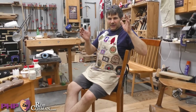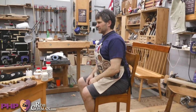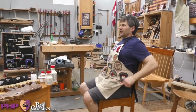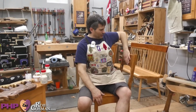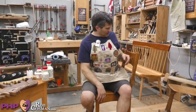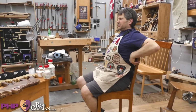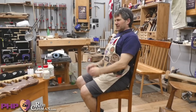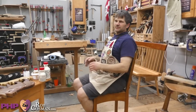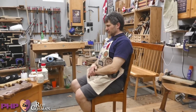So you've got to have the right angle tilting back. I've seen commercially available chairs where the back was straight up, and that's extremely uncomfortable. It's got you pushing forward like that. So you want just enough. When I did this, I just put a gentle slope on here so it would kind of accept your back and cradle you. If that was a flat back, it would be right into your spine. That wouldn't be very comfortable. So this kind of rests on your lats. Quite comfortable. And it's high enough that it's not on my shoulder blades. Low enough, it's low enough that it's not sticking into my shoulder blades.